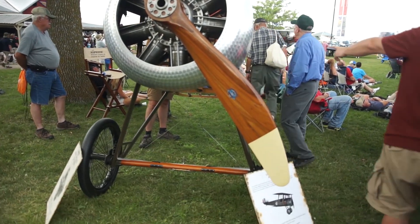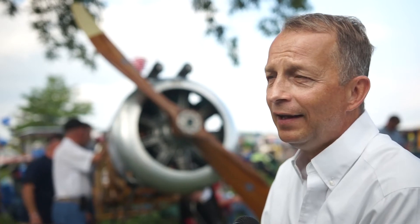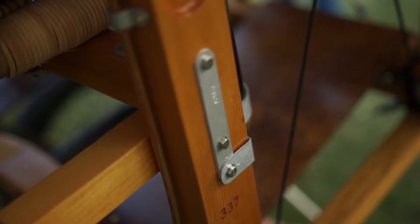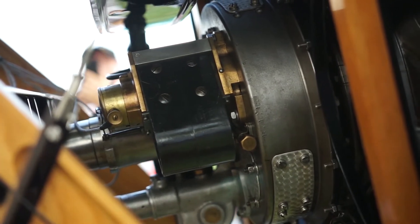So I'm forced into building the airplane. It's a very complex airplane, very difficult to build. And the nuts and bolts aren't made today — they're British standard fine. It's an unusual thread pattern, so I had to have everything machined. You couldn't go and buy anything commercially made; it had to all be handmade.